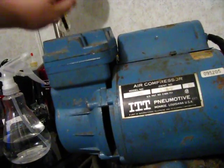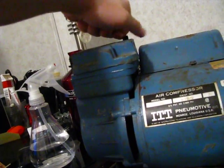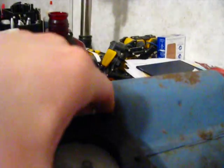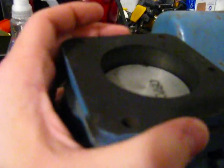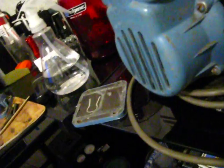I thought this was going to be a quick video, but I guess not — like all my other videos. Actually it's quicker in a sense; it's not going to be a half hour long. Okay, four head bolts. Here's the head, the bottom of the head, the plastic I have to take out, the top valve plate, the ports, the bottom valve plate, and then the piston. This comes off, and this also comes off. I won't be pulling it all the way up because I don't want to deal with the piston rings tonight. I'll be taking the head bolts and cleaning up all the threads, chasing all the threads.